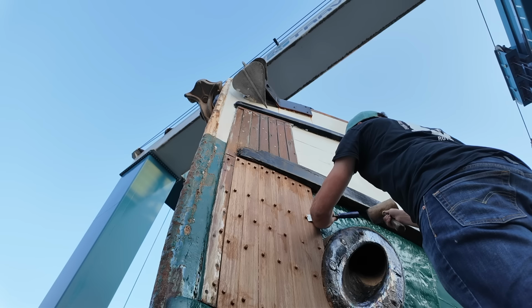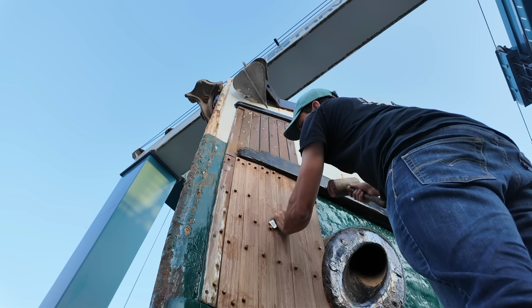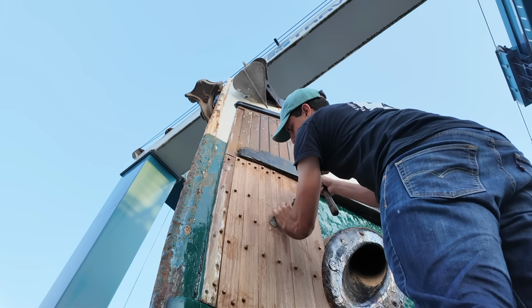It's a 4:30 wake up this morning to put a new gasket in the number 6 cylinder air start valve. Next, we are going to remove the bungs 2 hours till we go back in the water, and I think we are good to go.